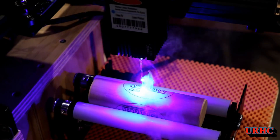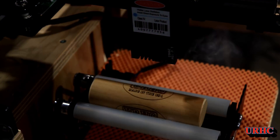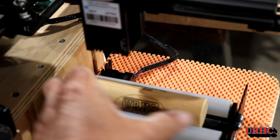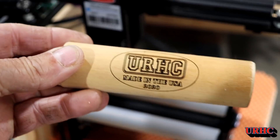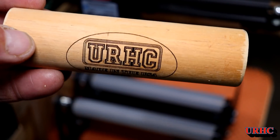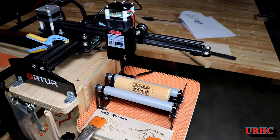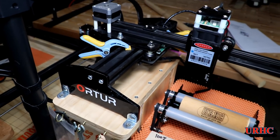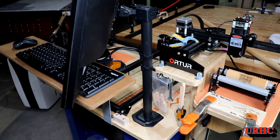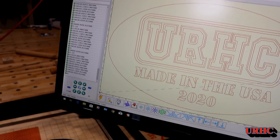It's only going to be good for things that are perfectly round, so I'm figuring out how to make adapters for spindles and other shapes, which I'll probably be 3D printing in the future. You can see it did a really nice job with no fussing. In LaserGRBL you have to make sure your artwork is inside the piece or it will try to frame and hit the end. Once I had the instructions and everything assembled, it didn't take long. Just make sure you follow the instructions for disabling the limit switches — change it from a one to a zero in the setup.